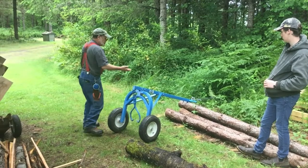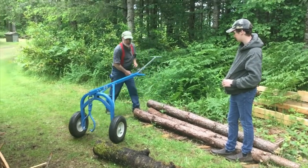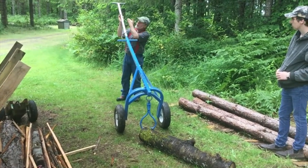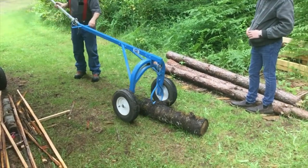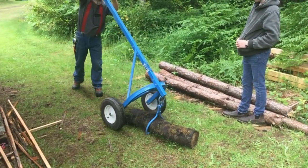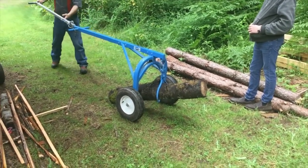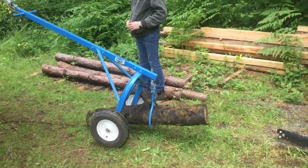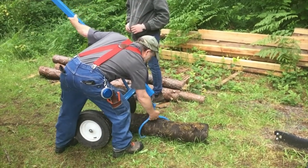So the action of this junior arch is simple, what he calls toggling action. And I'll also point out, we have put the extra extended arm on so we can drag longer lengths. But you just back the arch over, drop the little hooks into place, and then pick the log up. Now you can balance it so it's perfectly balanced, or you can just push it along. And the nice thing about it is when you're ready, it's a simple action to just unlock it, slide it over the top,